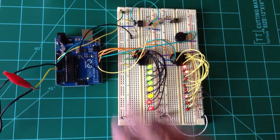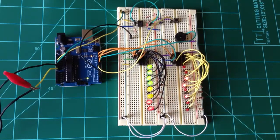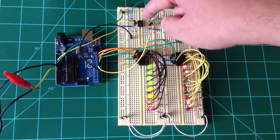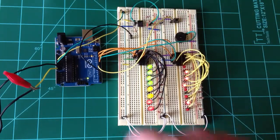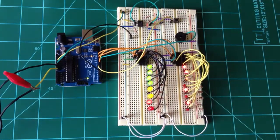The LEDs are being driven by the main loop of the Arduino sketch. The music player is being powered by interrupts. The source of my interrupts is this 555 timer chip setup up here. It sends an interrupt to one of the Arduino inputs about 31 times a second, and that drives a state machine so that the music player and the lights operate completely independently from one another.